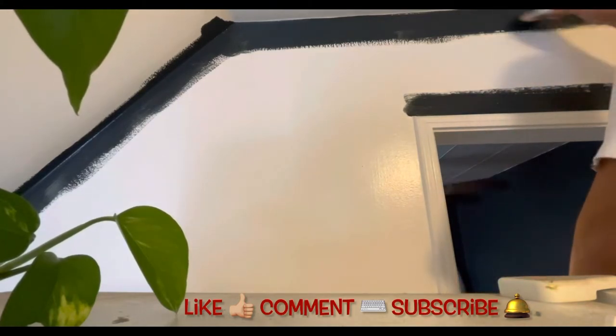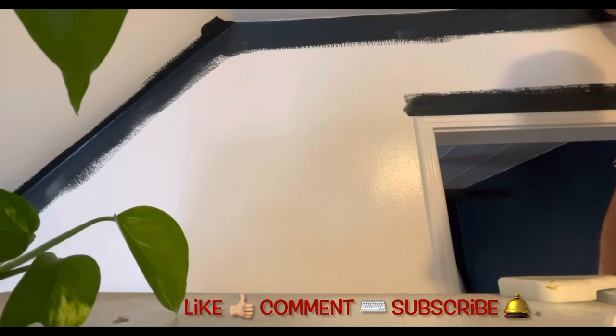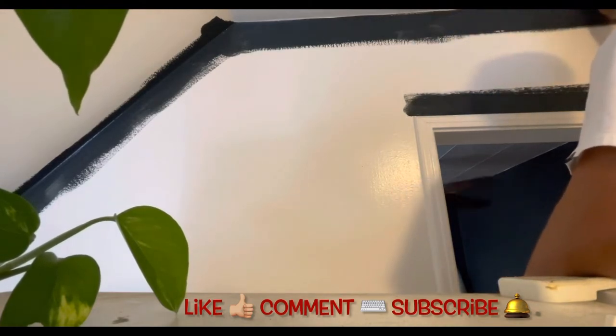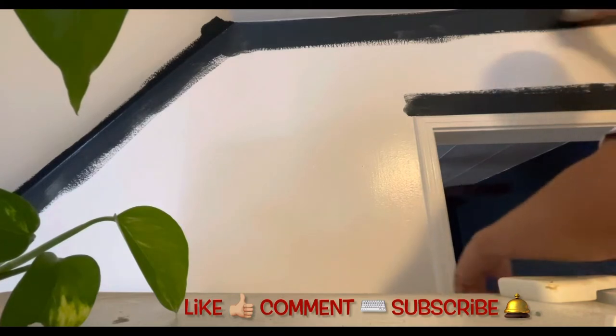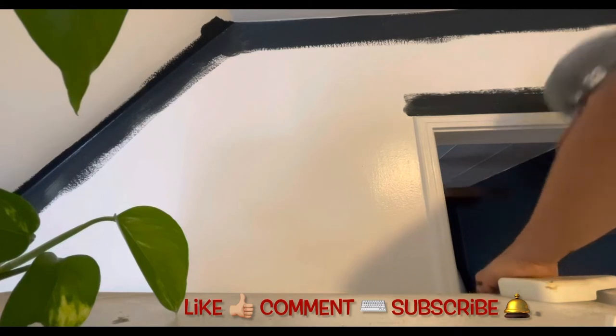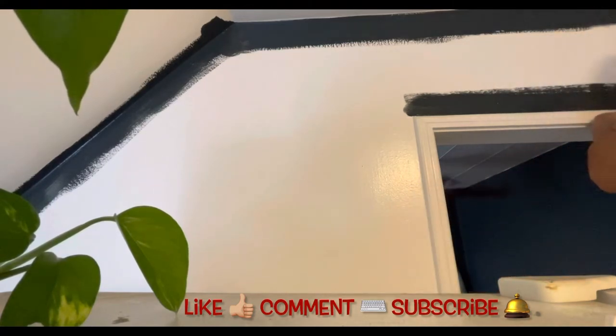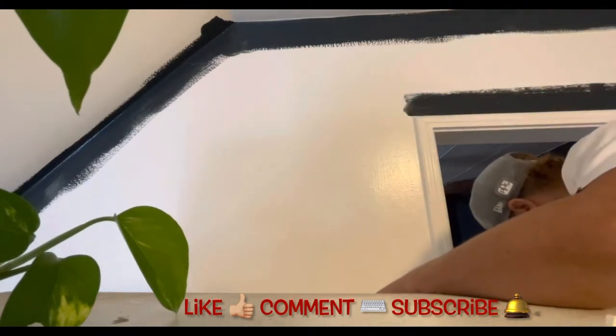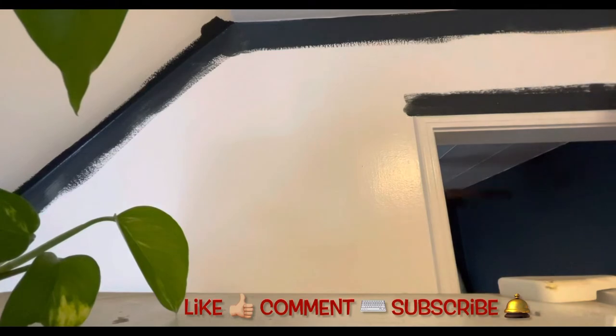Also, my G's, another tip. When you put that caulking, you don't have to let it dry, because when you remove the tape, the caulking is gonna be all dried up and you're not gonna have that straight line. So make sure when you guys put the caulking, paint it, and then remove the tape. And the tape, you have to remove it against the painted wall so you can have that sharp straight line.